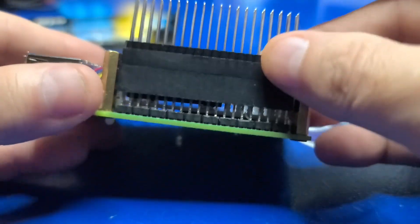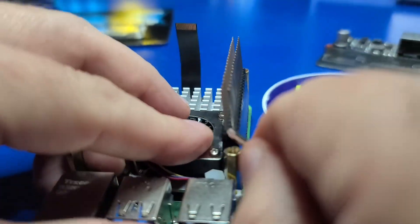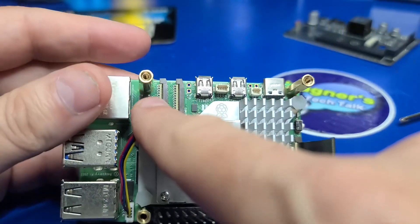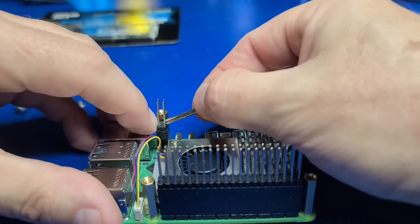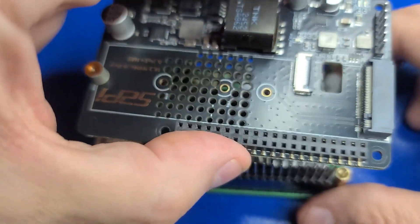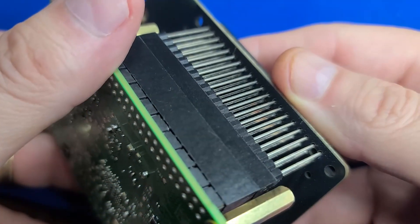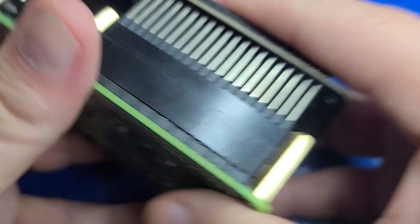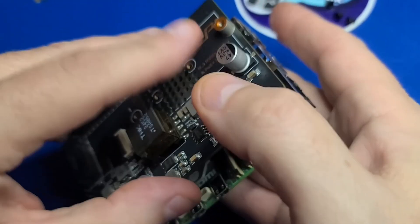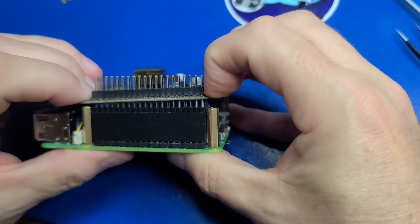Insert the '2R Pi 5' end into the PCI-E port, then push down on the black connector to lock it into place. Take the GPIO extender and line up the pins over the GPIO port. You can walk it down on the left and right sides, or use a screwdriver to push it down on each end until the connector is flush on the Pi. Now install the 4-pin header into the pins behind the Ethernet port. Take the hat and feed the '2Hat' end of the FFC cable through the hole in the hat, then line up the GPIO pins through the connector on the hat and bring it down, making sure the 4-pin connector is aligned with the holes on the hat. Once both connectors are lined up, bring the board all the way down flush with the standoffs.